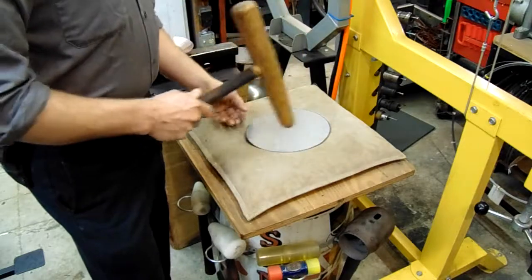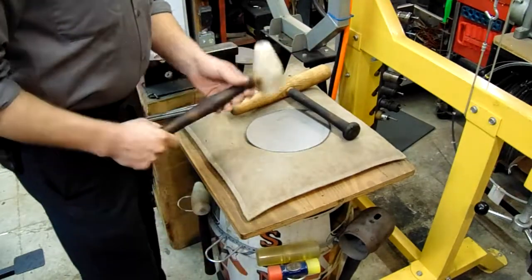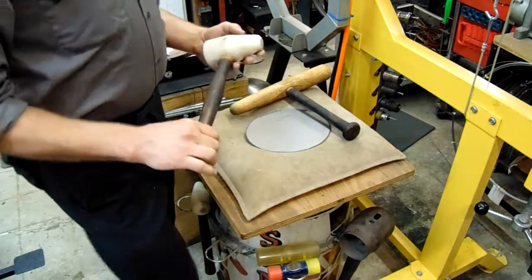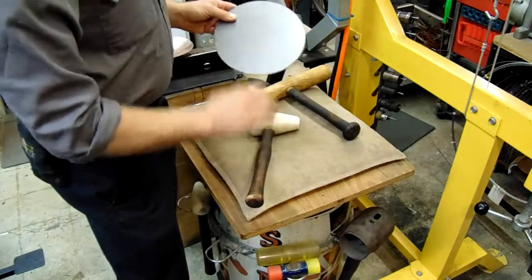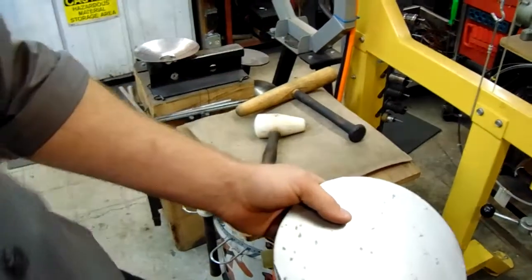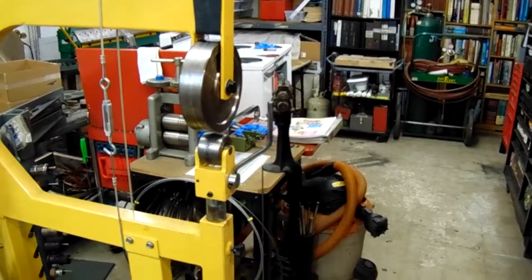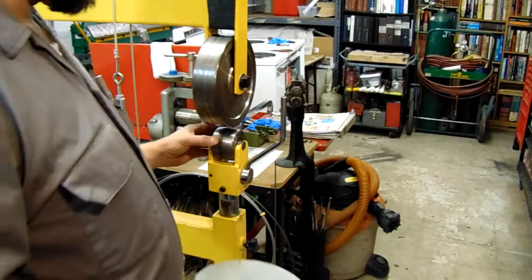Now I switched to this end, worked a little more because it's a smaller end. Now I went to this hammer, which is a professional made hammer, and worked it a little more with that and got the initial stretch. After that, I came to the English wheel and I put a little higher crown